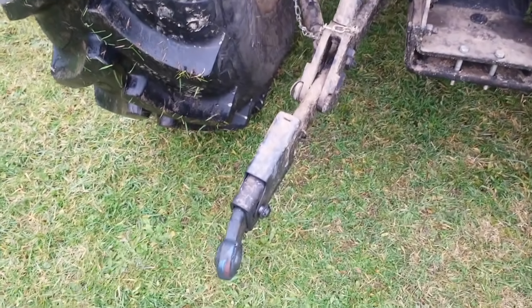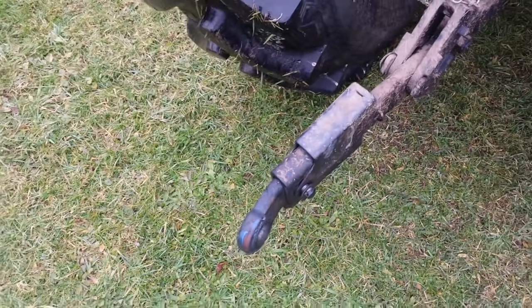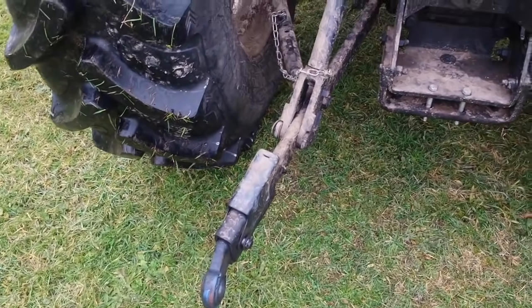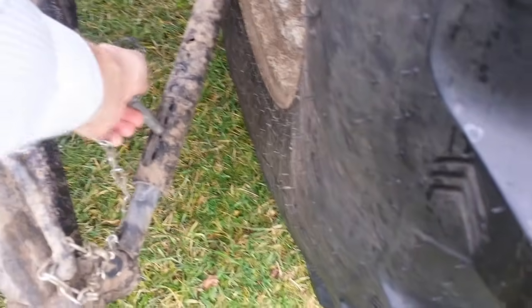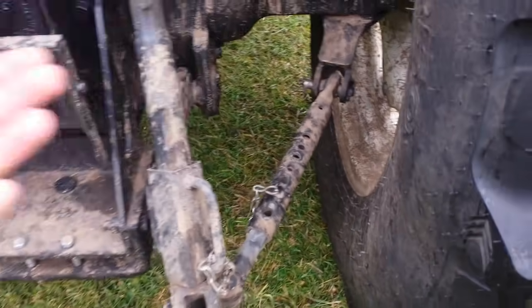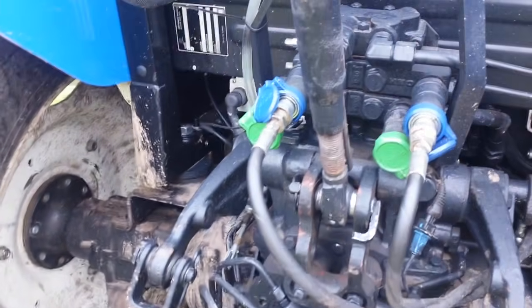I really enjoy having the flexible three-point link arms on the bottom — you can push them in and pull them out to get close with your three-point implement and then do fine adjustment with the adjustable link arms. Another improvement I made was putting the hitch pins on a tether chain. I have a tendency of losing them, and if you're driving in taller brush the pins can lift out. It also just makes it easier — you pop it out, get everything lined up, and pop it back in.